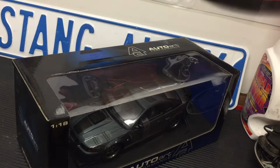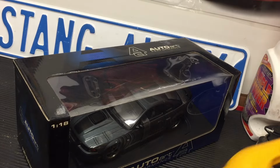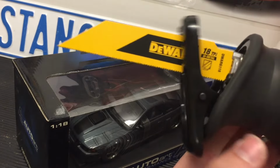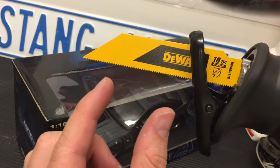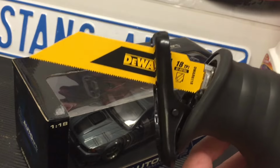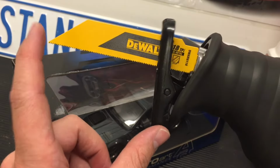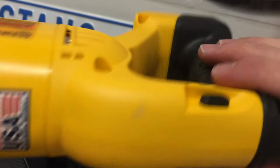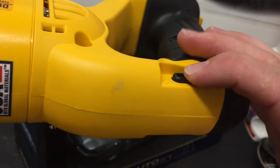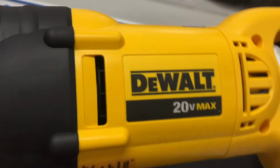So anyway, that's the reciprocating saw in a nutshell. And so hopefully you enjoyed this video, and you're going to make sure when you're cutting that you know what you're cutting, that the blade will overhang it, that you're using at least a blade that's 3.5 inches long from the shoe forward, that you always have it locked, and battery out of it when you're carrying it around, because something, your tool bag could bump that, and the next thing you know you're rocketing around and chewing through things.